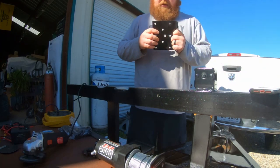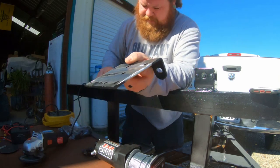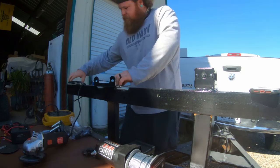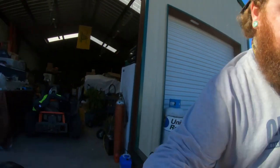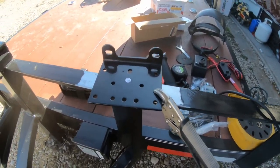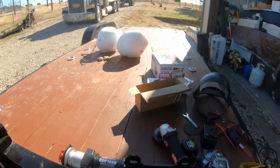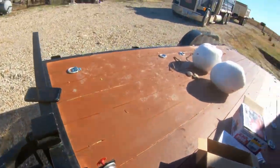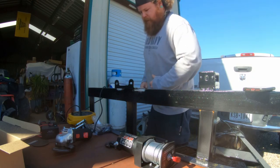I did back here because I'm going to shoot beads down right here. I beveled both sides of this, and on the trailer I beveled it on the edges right here — that way I can try to get a little bit deeper of a weld on there. I got it clamped on. You can probably tell it looks crooked — that's because it is — but you can see the bevel down in there on both sides to get some good penetration. I have it a little bit crooked because if it goes straight back it should hit right in the middle of the trailer, to keep the cable from binding. So I'm going to get my welder hooked up and see if we can get this thing tacked in.